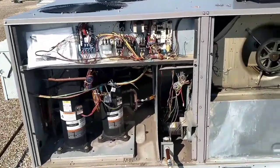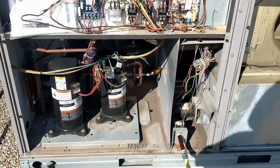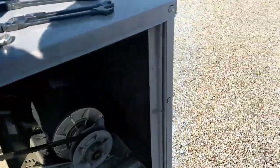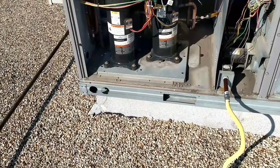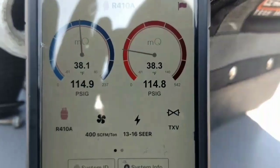This is what I've figured out so far. Both pressure switches are open on the low side. They cut out at 54 psi and reset at about 117 psi. What I've noticed is my standing pressure right now is approximately 114 psi — so it's right about at the edge of where it wants to reset.